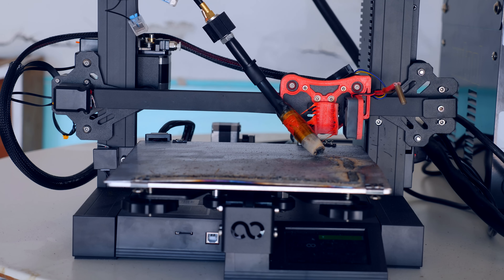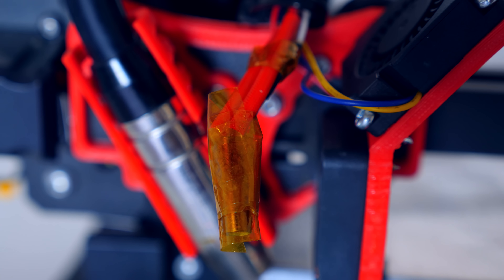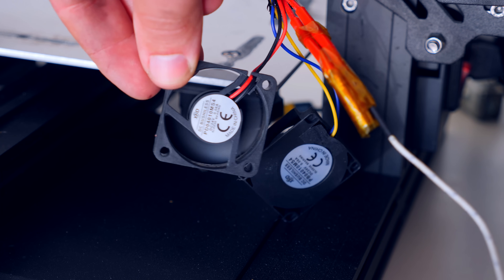The support melted. One of the reasons was that the fan was not turning on. Apparently, on 3D printers the fan only turns on when the hot end is at a temperature above 60 degrees Celsius. My mistake was that, because I was not using the hot end, I had set the temperature to 20 degrees Celsius. To fix this, I taped the heating element and the sensor together and set the temperature to 60 degrees. The fan now works.